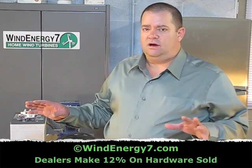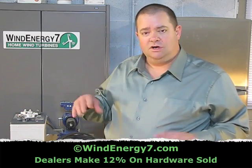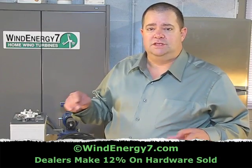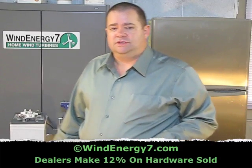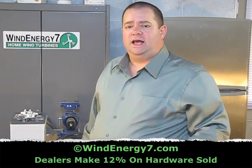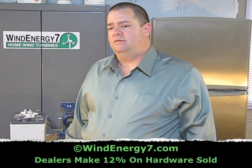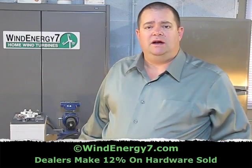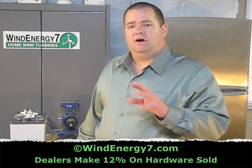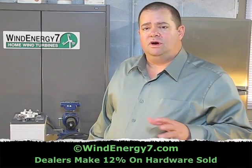With all items in green energy and renewable energy systems, all your wiring — the bigger the better. Same with battery cables. I've seen battery banks with cables bigger than my thumb — gigantic overkill in a battery cable. Bigger is better. That may be a little extreme, but the less resistance, the less power you're going to lose in transmission, so the more efficiency.